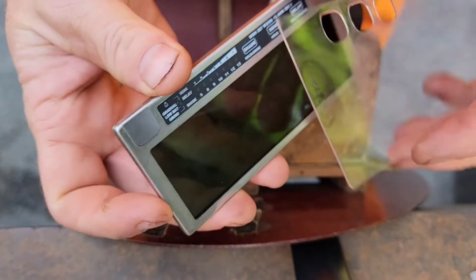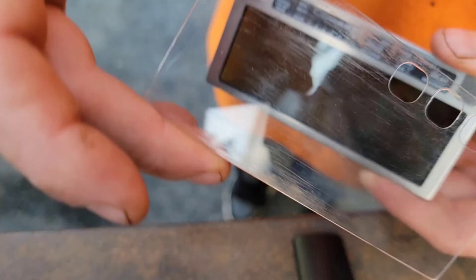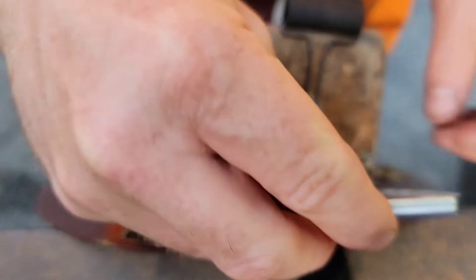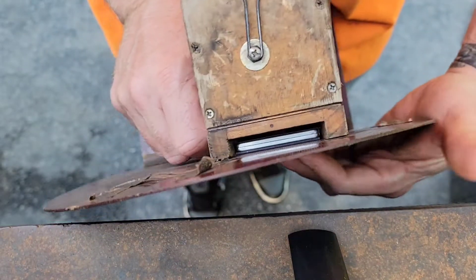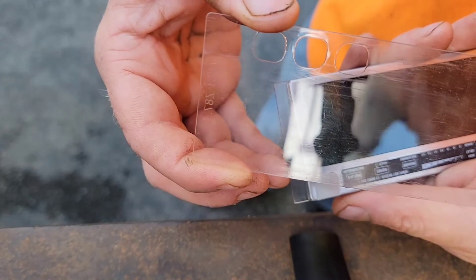It's a little hard getting in and out doing that, but this TechnoWeld lens comes with a cool little cutout clear lens in the back, which will be worthless in a week. And what sucks about it is the cool grind feature you have is almost worthless unless you take your hood apart and push the button and push your lenses back in. I'm sure they probably sell replacement cutout lenses for these things.